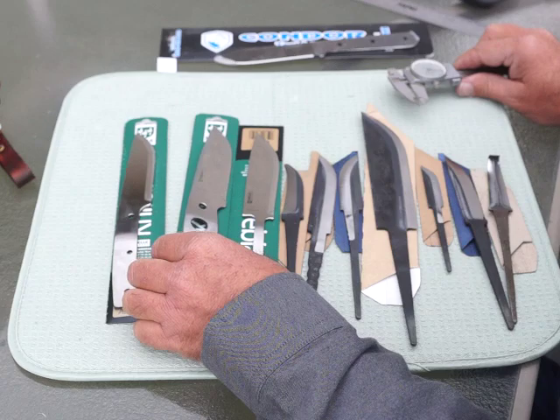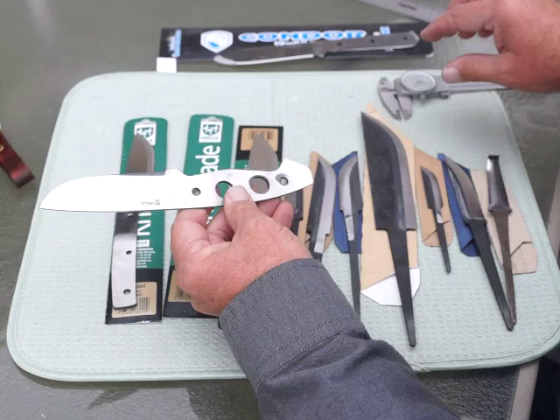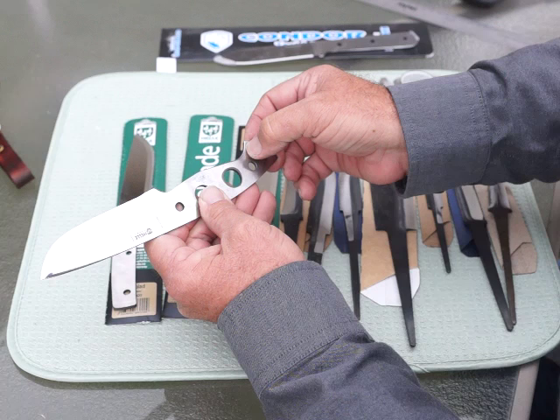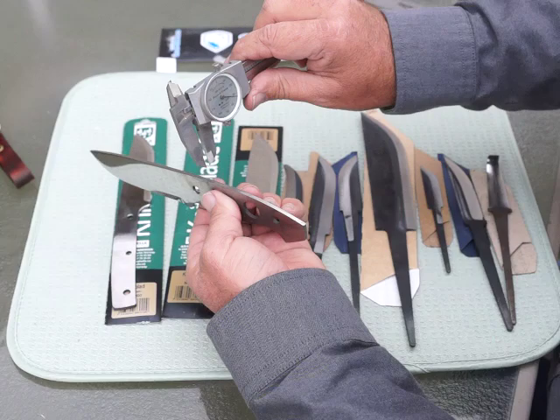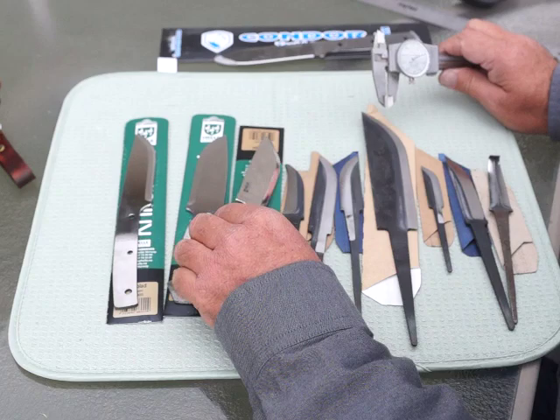The next one over is basically the only full tang knife blank they offer at this time — the Utvar. The Utvar is Sandvik stainless. As some of you have seen in my other videos, I'm not real happy with this part of the Utvar. What I do when I make these is open it up about an eighth of an inch there, and maybe a little more than an eighth of an inch to the back. Rather than put the short scales on it like they do at the factory, I take my scales all the way to the end — that just makes it feel like a much bigger grip. It's also about 0.115 in thickness.